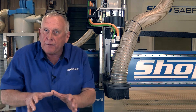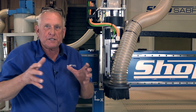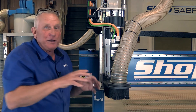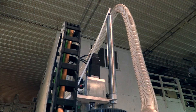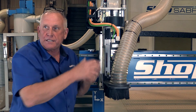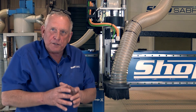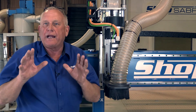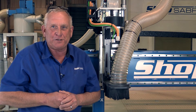Once we developed that, we came back and said let's perfect it. That's what you see in these cutouts — we were able to achieve the same stiffness with less mass. Now when you start talking about mass, there's another part of this design: the balancing cylinder. Think about all these things that are lifted and dropped as the machine runs the Z-axis — mass is weight when you add gravity. It's a lot easier to lower the head than to raise it. So we use a balancing cylinder that counteracts that, making it just as easy for the machine to raise the head as to lower it. In real life, that gives you the ability to machine in 3D much, much faster.